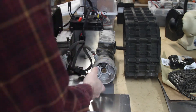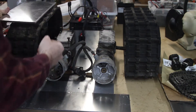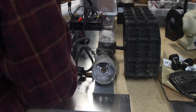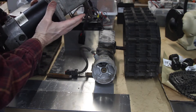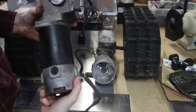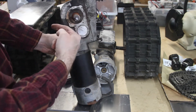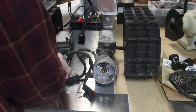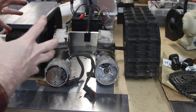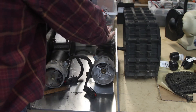What's my plan for fabricating this piece? When you bolt these two together, that is the critical strength point in this design. Because these motors don't have any bolt holes on the bottom, you don't want the motors hanging down — you want ground clearance. So the motors go in this way and then get bolted together with a plate. That plate makes the main basis of the whole frame. That's where I'm starting: get this plate made.